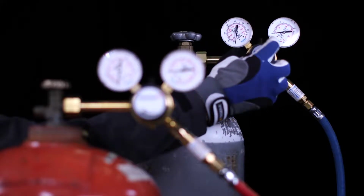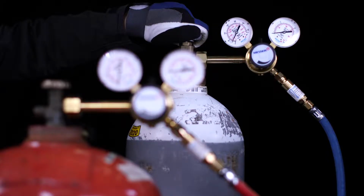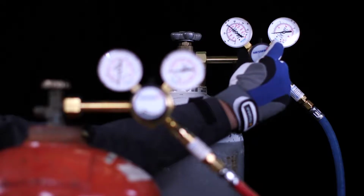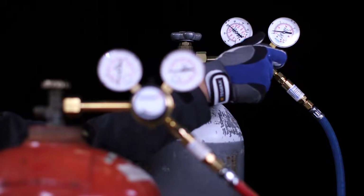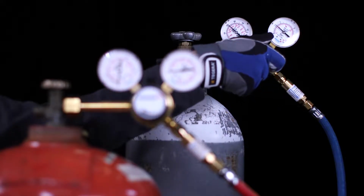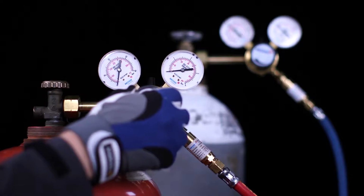Before opening the cylinder valve, make sure that the cylinder pressure regulator is released. The adjustment handle must be completely screwed back. Open the cylinder valve as slowly and carefully as possible to avoid a pressure surge. Set the required working pressure according to the cutting table by turning the adjusting handle on the cylinder pressure regulator. Carry out the same sequence for the fuel gas pressure regulator.